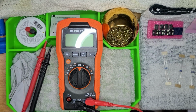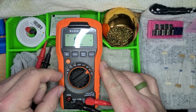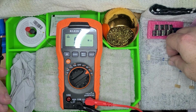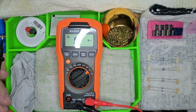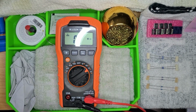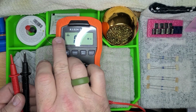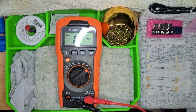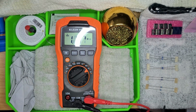Okay, we've gotten to the point where I've gotten all of the components taken care of, except for the last few of the resistors, and they are taped off, but I have 4 different values that are taped in pairs of 2. And so this is just a brief overview again. If you don't remember or haven't seen the other video, essentially take your multimeter, turn it to omega for resistance, and I hit select so that it's auto. You see the little omega sign right there. Take your negative and positive. Negative on one side, positive on the other. 1.007.